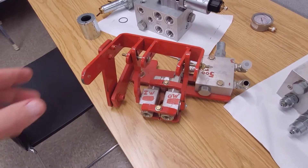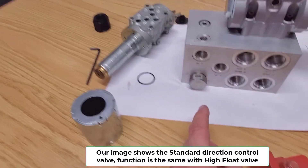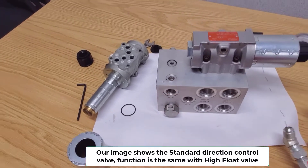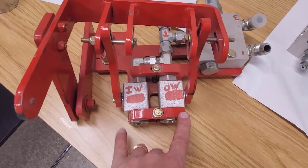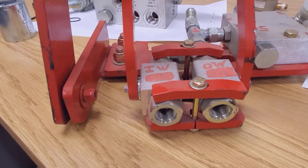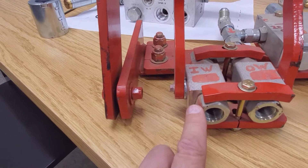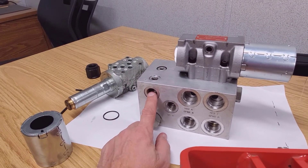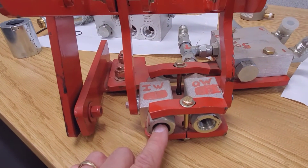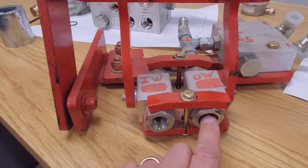What we're looking at here are the sequencing valves for the wing lift system. When we're winging out the drill, the WLP oil comes over to this port and sends the oil out to the outer wing and inner wing. When the wings are up in the air, the outer wing valve is closed and the inner wing valve is open — ported directly through to the tractor. So tractor pressure is sent to the base end of the inner wing cylinders to unfold them, with no oil going to the outer wing. It's held in place.